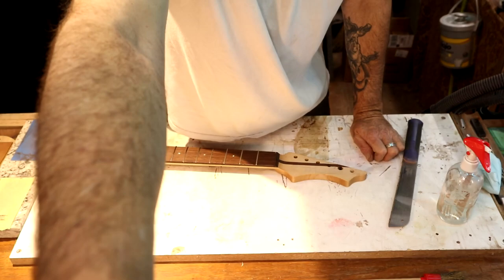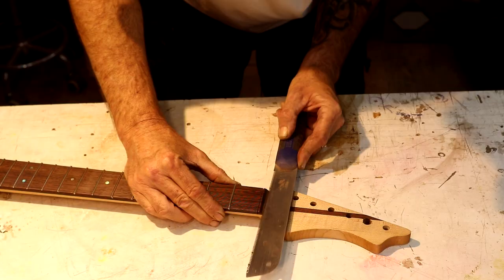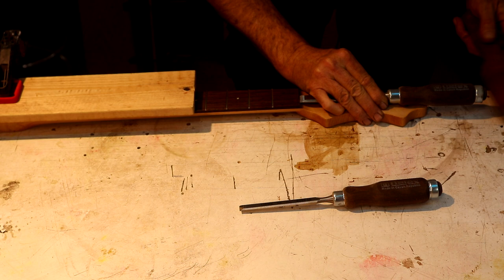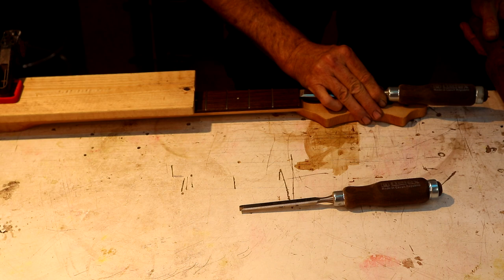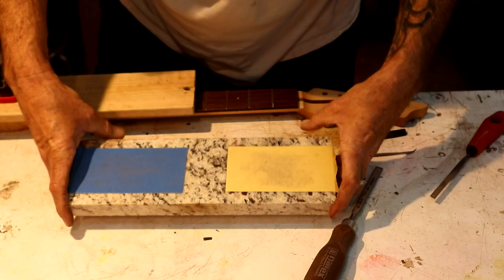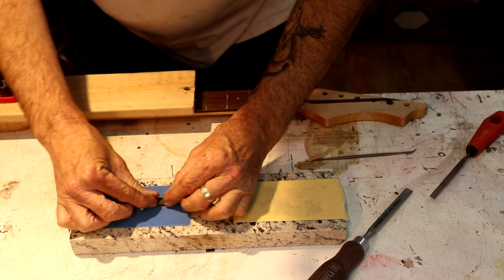What I've decided to do is after I drew that little line, I scratched it with my scalpel — the chisel is going to follow that scalpel line. We should just be able to flake this out — I don't want to do the whole thing at once though, I want to go very gently and flatten out the bottom part of the shelf here. I've got a piece of 180 sandpaper and a piece of 400 — the 180 allows me to remove a little material and then the 400 polishes it back up.